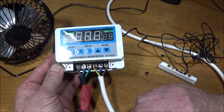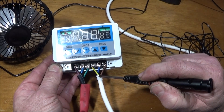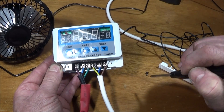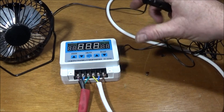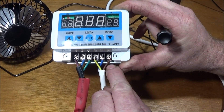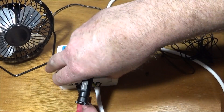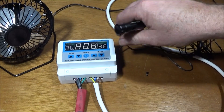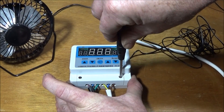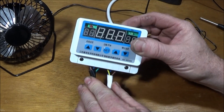This is the correct way of wiring it up. On this side is the input — you have the live, the neutral, and then the ground. Then you have the output line with the ground on this side, then the neutral and the live on the far right. When you wire it up, make sure the copper is right into the terminal and not overhanging the white plastic part — that way when the cover goes on there won't be any overhanging wires where you could get a shock. It all looks nice and neat when the cover's back on and it's safe.